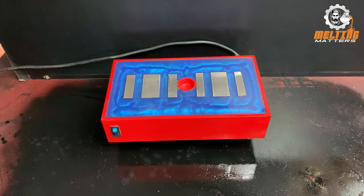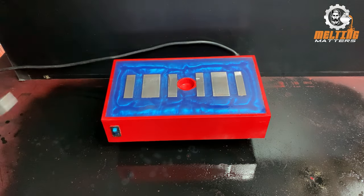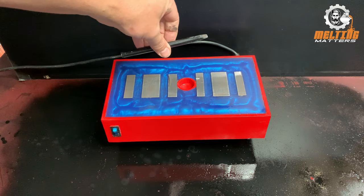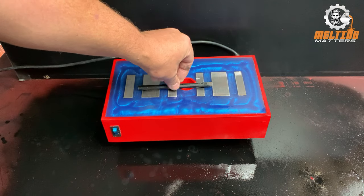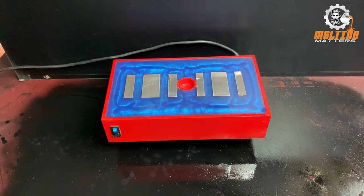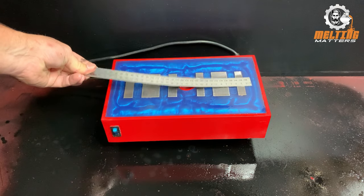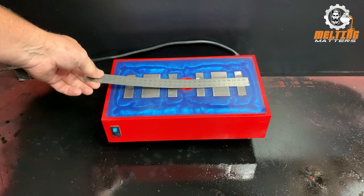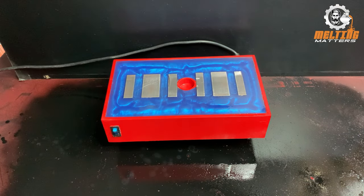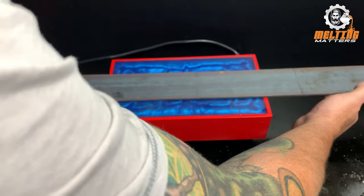I've got it tuned down to about five volts with four amps so it's not strong by any means. When I ramp it right up to 30 volts at 15 amps, you'll find that thinner material can't allow the magnetic flux to penetrate through to give full strength, so you lose a lot of force with thin material. But I'll put a piece of five-millimetre steel across the plate and I just cannot budge it. I'll do a proper lifting test in a future short video — you can see it really slams down and barely moves.